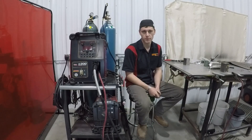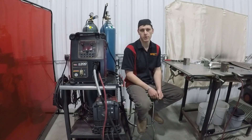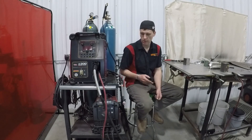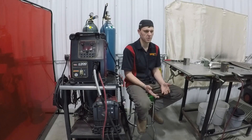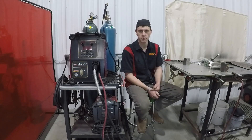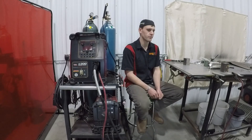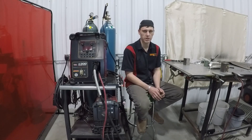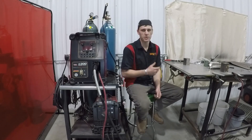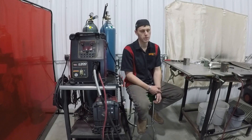That concludes the review of the Aspect 230 - not only the aluminum welding but the welder as a whole. My demo period has ended and I'm back to using my square wave for now. In conclusion on the aluminum welding, the Aspect 230 really shines on the aluminum side. If you're looking at upgrading from a square wave 200, hands down the Aspect 230 is absolutely worth the upgrade. The features really lend themselves to increasing the weldability of that dirty cast aluminum on automotive parts, and I definitely noticed a big difference welding the cleaner 6061 as well.